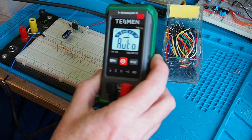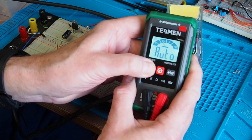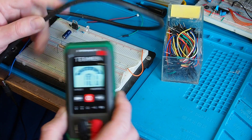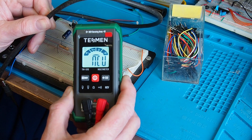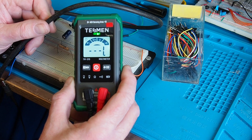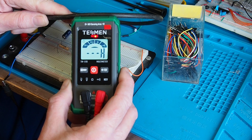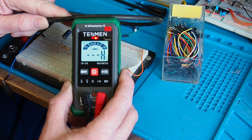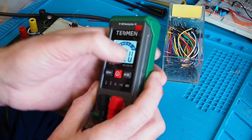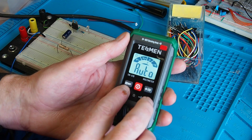The other facility worth checking is the NCV function for detecting the presence of a live cable. A long press on this button puts us into NCV mode. With a live cable nearby the sensing area at the top already picks something up — we get slow beeping and a green LED with 'L' indicated as we approach, and as we move closer it beeps faster with 'H' and a red LED right next to the cable. That's the NCV function — the display shows 'NCU' as it can't display a 'V'.